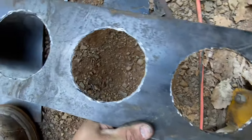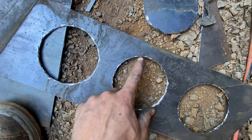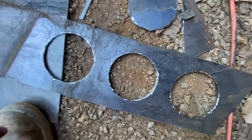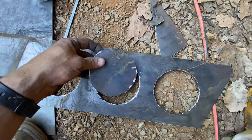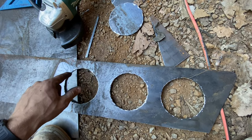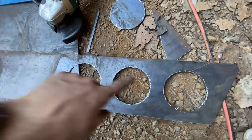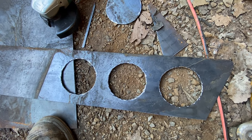I haven't touched them up yet — that's just with the cutting disc. They're a little bit in from the line, just a couple cuts might go a little bit over, but no stress — the rubber and the lights cover it. I was just doing it with the grinder, heaps of little ones punching through around it, and then I'll clean that up with a flappy disc and get it smooth. That should do the job pretty well.